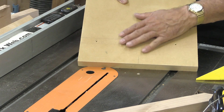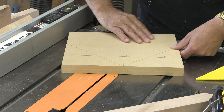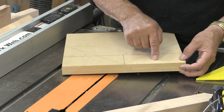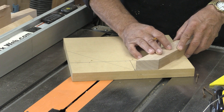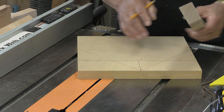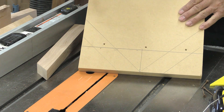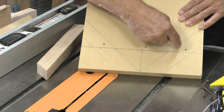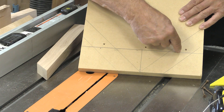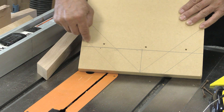Now I'm back working on the upright. This is the side that is going to be out, so that will be against the fence. But I'm reversing it and working on the back, because it's much better to drill holes through MDF than it is to drill into MDF. I'm going to drill holes through here, and through here, and the same on the other side. I forgot to mention — this is an important line across here, because I don't want the table saw blade to come any higher than this line, because that's where there's going to be screws. As the wood slides through the table saw, I need to make sure the blade does not exceed that line, because I don't want to hit those screws on either side.